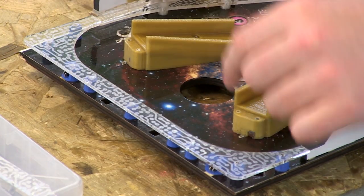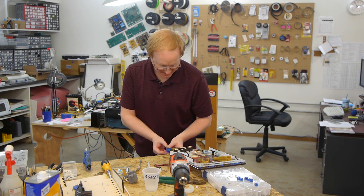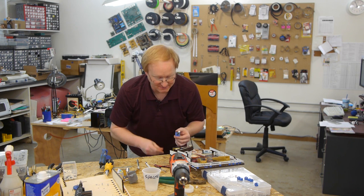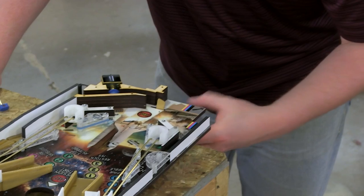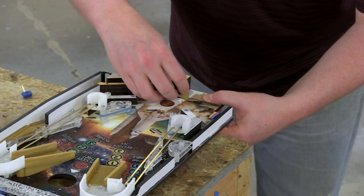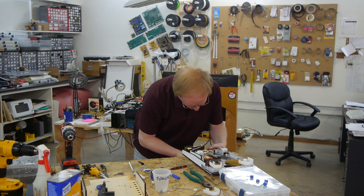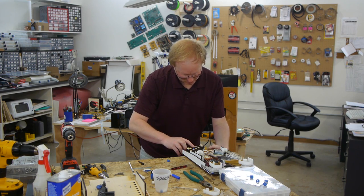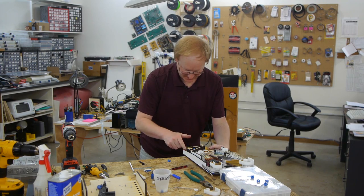The second layer of plastic has a cutout in it because it needs space for that loop. I'm kind of curious about how much force this little shooter rod is going to have — I'm worried it might have too much. Let's test it out. That works out pretty well. This is a solenoid kicker mech I designed — the solenoid pulls in the rod causing it to kick over. I want to use this to unload the drain, so I'm going to mount it down here. When the ball drains it'll go right here. To detect the drain, I'm going to put an opto underneath pointing up through the slot with an opto pair looking down at it. When the ball breaks that beam we know it drained. Then to load another ball, the blocking solenoid will release and the kicker will snap over and the ball will load.